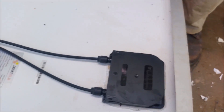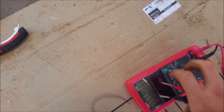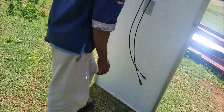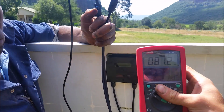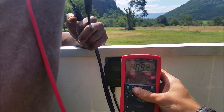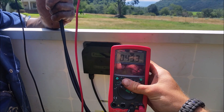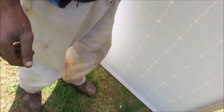Let's go check if it's working. I'll get my trusted tester — still building my new workbench. If you remember, it was only millivolts before with the old junction box. Now with the new junction box, connecting negative and positive — and there you see: 43.3 volts! So if you're lucky and your panels have been struck by lightning, this is a way you can repair it. Thank you for watching guys.